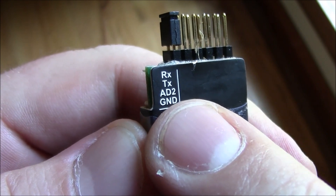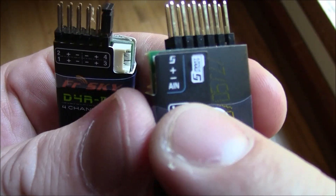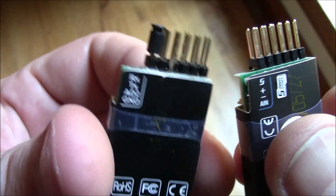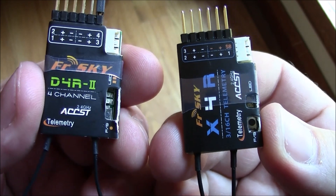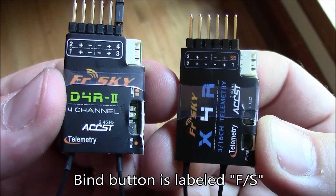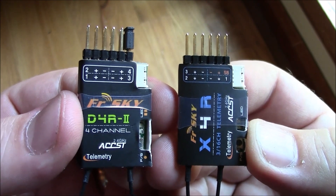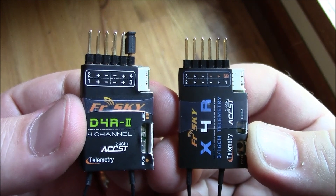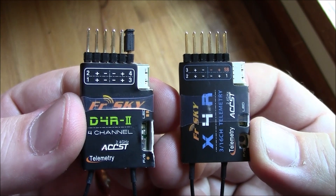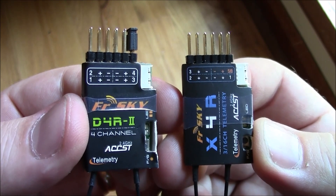That's where you can plug something in like your FBVSO1 so you can get your battery voltage. This one also has an A1 input, but they mark it here as AIN — it's the same thing as the A2 input on the D4R. Both of these bind the same: you hold down the bind button on the receiver, power on your craft, and it binds to the transmitter. They both have failsafe — once bound, before you arm your multi-rotor, you stick the sticks in the direction you want for failsafe, push the bind button briefly less than a second, and it saves your failsafe settings.